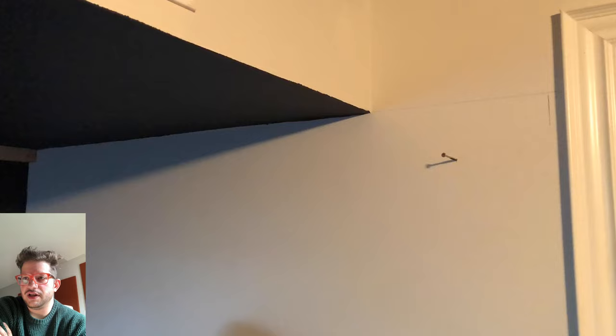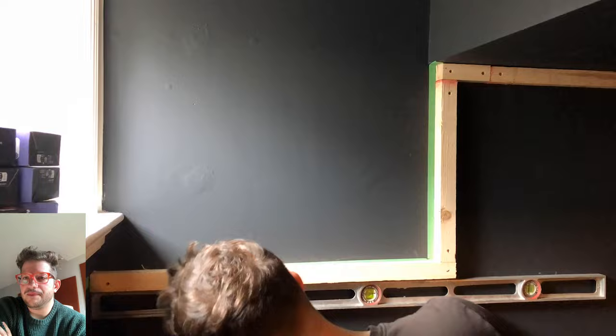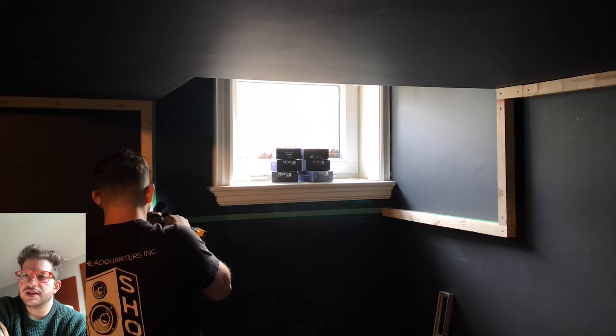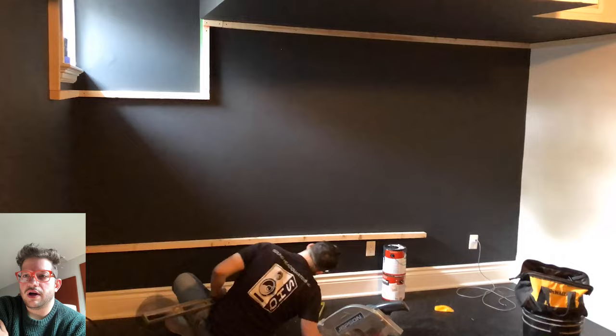I left three quarters of an inch before the door casing for our final trim, and doing the same around the opening for the window. We did everything in masking tape first to get client approval, and we can go right on top of that — it'll get covered with the final trim. Above the outlets we left all the electrical exposed for the client's convenience and so we have access to run electrical into the wall for the LED lighting later.